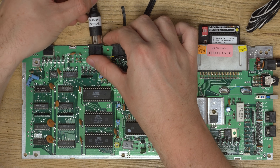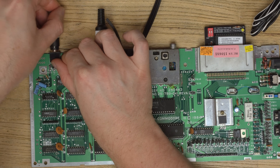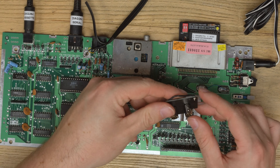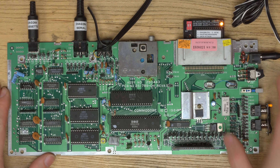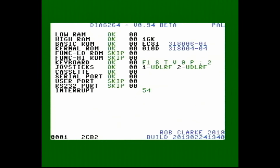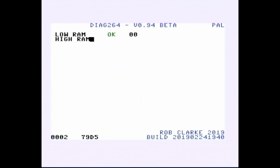Let's validate there's nothing else wrong. I'm going to use the diagnostics serial port block, the cassette block - these allow loopbacks so ports can be tested. I'm also plugging in the keyboard loopback tester to test the keyboard, and the joystick connector. That's all the jigs in. Turn back on and let the test run. The keyboard, joystick, cassette and serial have all instantly tested OK. The VRAM tests run and there's a screen showing everything successful, then the test starts over.